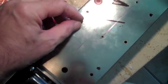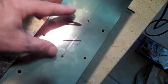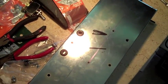I put my rubber grommets in the holes where the output transformer wires will feed through. I had to drill this extra hole so the wires would go to the impedance switch. I also had to drill two holes for the circuit board mounting screws. With this chassis — it's not specifically for this kit, it was the best chassis they could find — so if you buy the kit, plan on drilling some extra holes.